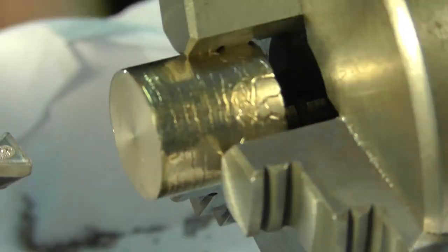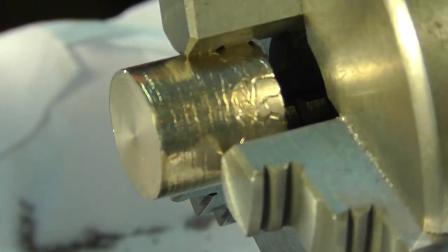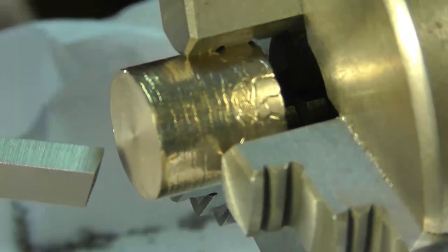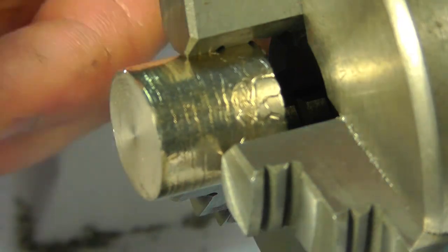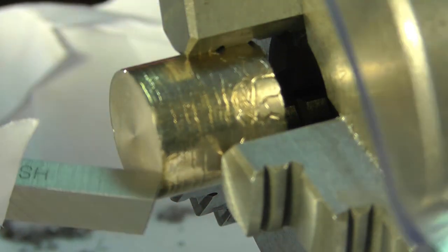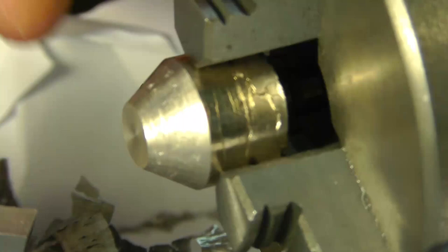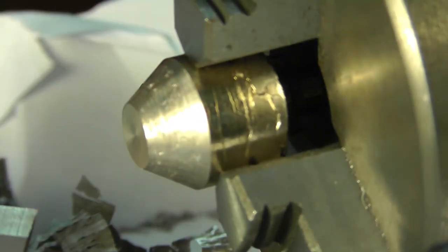But you're going to want to just cut the front edge off and clean it up nicely, and then go ahead and cut your bevel. The only real important thing is I would not make the top surface that's round and flat any smaller than the size magnet that you'll be levitating. These magnets are currently N42. The bottom magnet is a 3/16 inch cube, and the top is a 3/4 inch by 3/4 inch cylinder magnet.